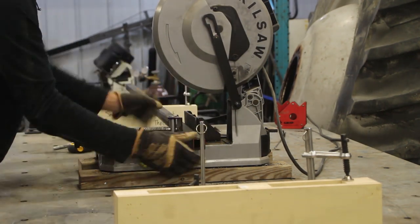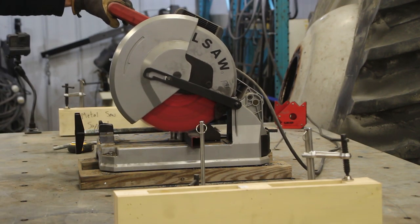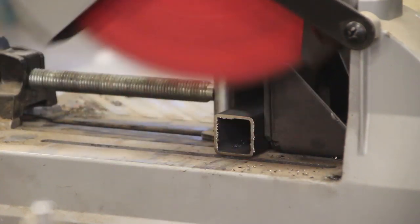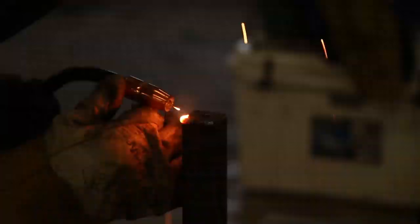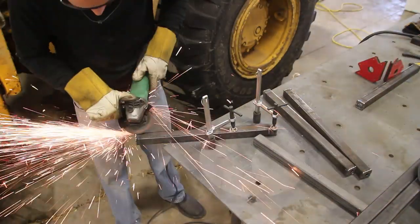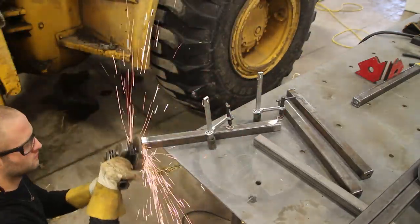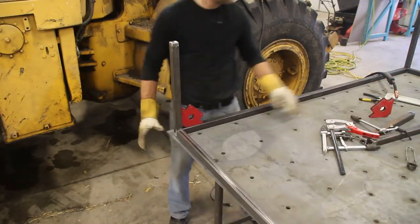What I decided to do was dismantle the doors, make them as flat as possible, and then use some one-inch square tubing — kind of thin, medium-walled tubing — cut up into a strategic design using a dry cutting saw. I'm going to weld on some plates on the bottom for leveling feet that we'll install later, and grind all those welds nice and flush to present a clean project at delivery.